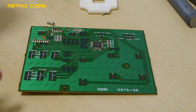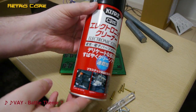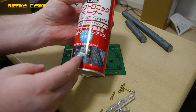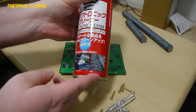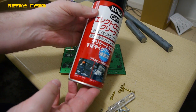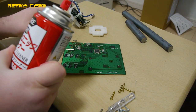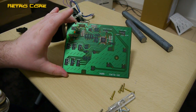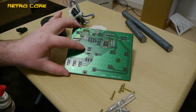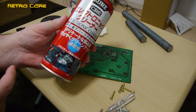If you need to clean the circuit board, you can't put water on it, so what do you use? I recommend something like this - it's called electronic cleaner. You can use it on car battery terminals and electronic components. It's non-conductive and works on pretty much anything electrical. These usually come with a little straw, similar to WD-40, which you attach to the nozzle and spray on components as needed. Looking at this particular board, I don't think it needs a clean - it's perfectly fine. But if you do need to clean a board, get yourself some electronic cleaner.